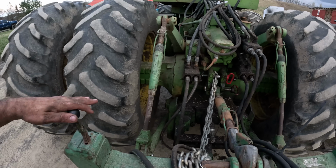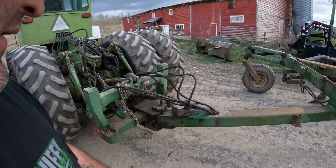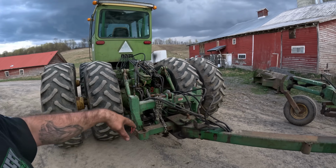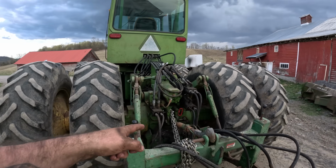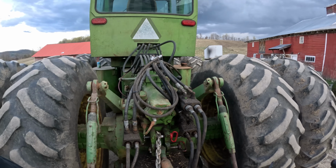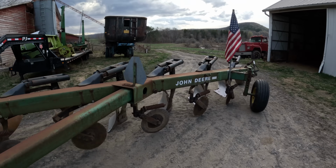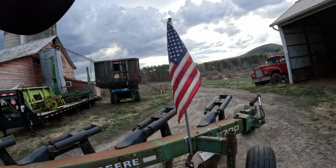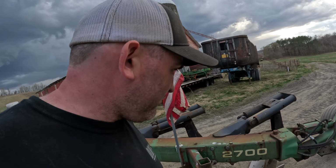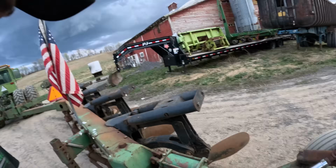This is my safety piece. So the plow is set at the right depth in the front because these lift arms like to float. We do got to do the seals. I think honestly it's this one and this one's steering, but we probably should do all of them. But yeah, it was a good day. Got quite a bit figured out. Every day we're gonna learn more and more. So tomorrow we'll just loosen these up, move them.